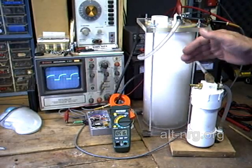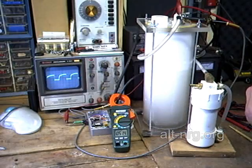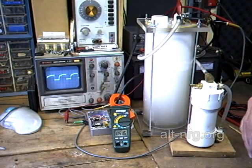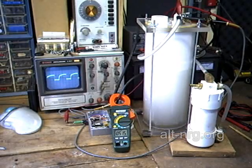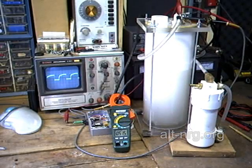You can see a lot of foam in here because I tried cleaning out the cell with some dishwasher detergent and evidently I didn't rinse it out completely. I'm just going to let it run like this to flush itself out, then rinse it out with distilled water a couple of times and replenish the electrolyte in the cell.